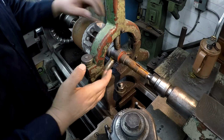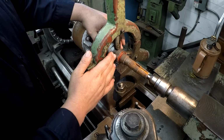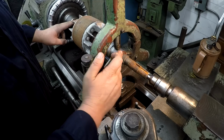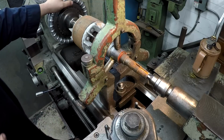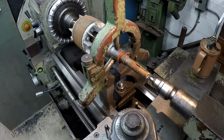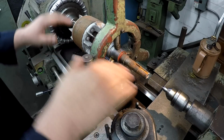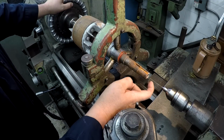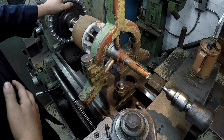And I go ahead and set the steady rest to the bearing journal so that it's running true here. This is where you want it running true. Your bearing journal, this machine true with your bearing journals, okay? And this should all be lined up with the journals there. So go ahead and get it set there and then back your center out. Now, with this being off a little, you're not 100% in alignment like you should be. But you're close enough that you can come in here and retool this, get it cut straight, then put your center back in it and reset your steady rest.